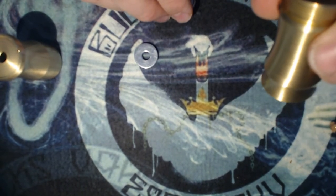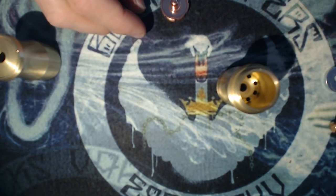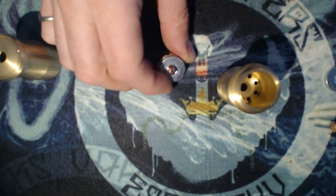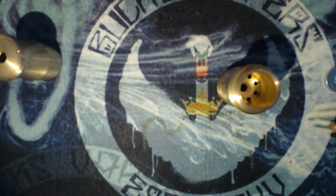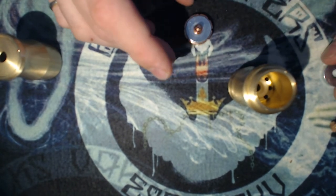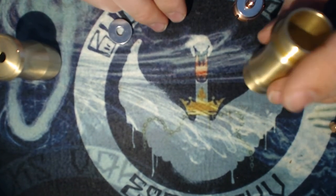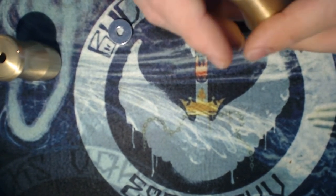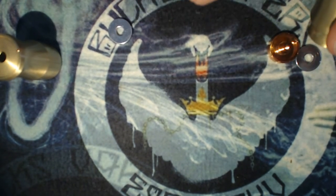There's a bit of Delrin in the bottom there to insulate the switch. It all fits together quite nicely. One little gripe: the magnet doesn't actually fit into the switch — it just rests on the top — so you can't push it fully in. But it doesn't really affect the performance too much. When you put it together you need to make sure that your magnets are opposing.